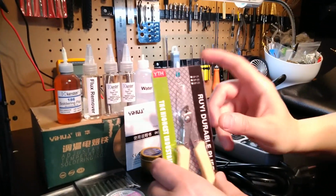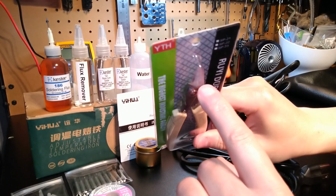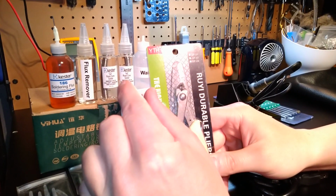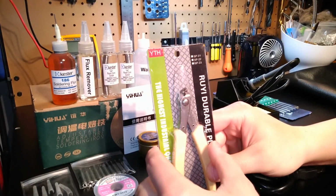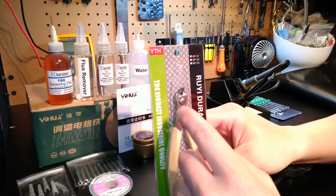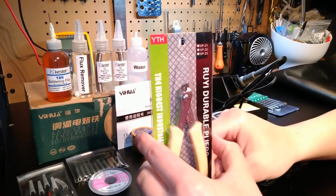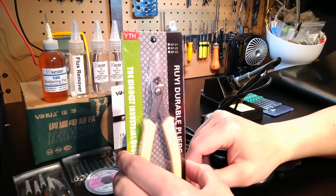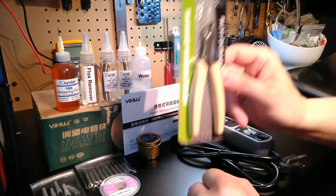The next accessory, this is one I use literally every day. You can see these are stainless. Okay, these are flush cutters and they're angled. See that angle right there? They are also spring loaded. If you guys are trying to skin leads or you're trying to keep the connectors close, so you're not having 40 feet of extra cable and have to shrink wrap because your cable casing is missing and you're butchering the cable, these are the only thing that's going to skin short leads. You naturally score the casing of the leads you're trying to strip, and you'll find the right pressure. I definitely recommend practicing because these are very sharp. You just lift and these will easily skin. They also will flush cut any wire, if you want to cut it on an angle or cut it flat. These are a gem to have, and I cannot emphasize enough when you're dealing with electronics with tight wiring, everything from zip tie removal, these work amazing and of course are included in the kit.